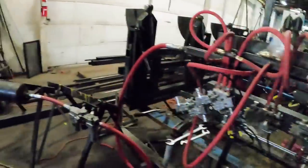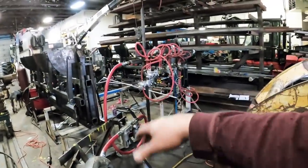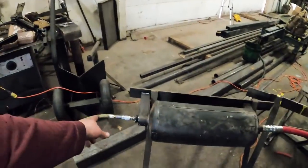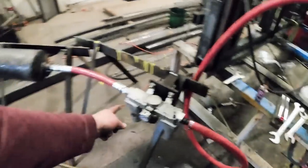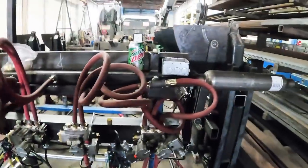Well, while I got my show off, Rick and Ball helped me, and Roger helped me, my boys helped me, everybody helped me get this valving together. It's not totally finished, but it's finished enough to get to the next round. This is all just on fixtures so I can operate it in the shop. The air's going to come in on a 1-inch line. I just got it hooked into this line to fill the tank. Then it goes over to the line conditioner, filter, regulator, lubricator, and then comes up to the pressure manifold. These lines will all be pressured, they're not now, because that's what we're getting ready to do. And then all the exhaust goes to the exhaust manifold and out the cherry bomb.